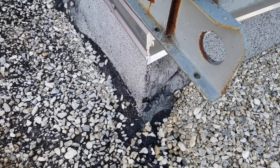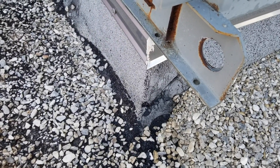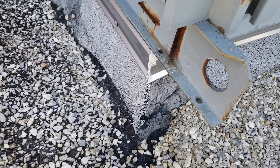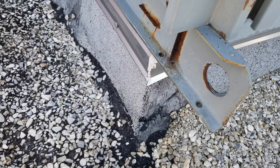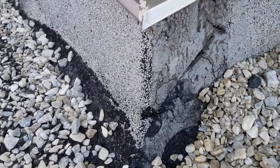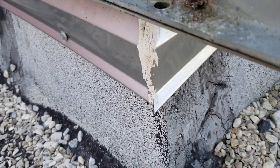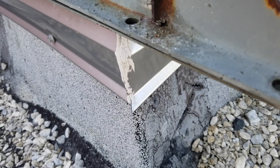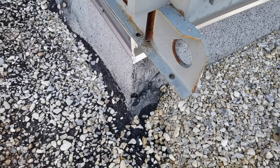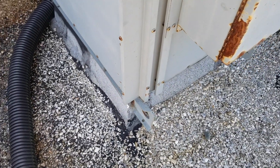Maybe it's sucking water in. Maybe it's not draining properly, although you can certainly see water coming out of the condensate drains. When we turn it back on, most likely the water's going to stop real quick and you're going to hear air sucking in. That makes me even more confident that it's not a roof leak.